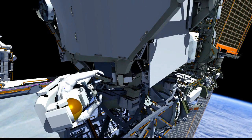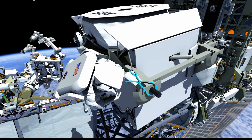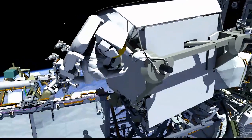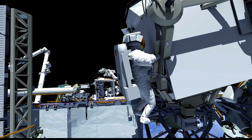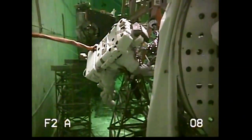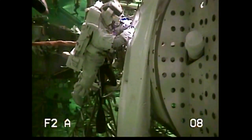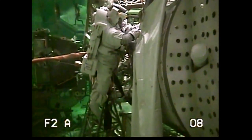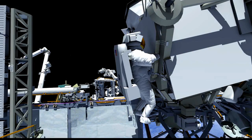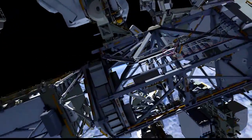The third strap — it's very possible to get into the APFR and tie that strap around a strut right there by the wedge, and then he'll move aft and zenith to protect the final area of staging there. Once we do that, it does have a grounding pin that we'll apply, and once the grounding pin is installed, we're complete with both the AMS small blanket and large blanket to protect their pumps. Here's an MLI video just showing the actual size of the blanket as it's deployed, working down what would have been the nadir part. So after we get the two blankets installed and the MBSU MLI removed...